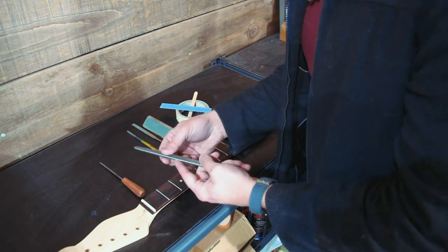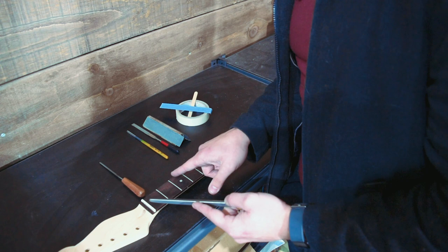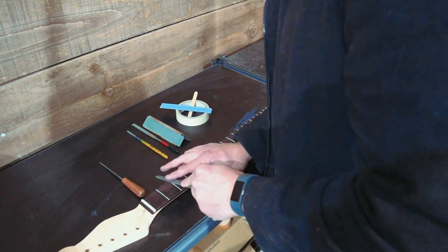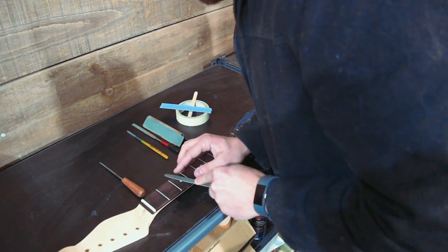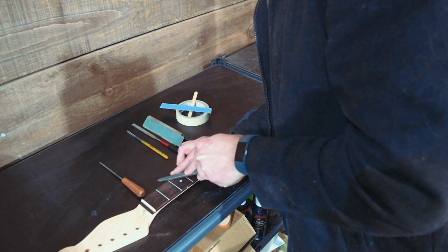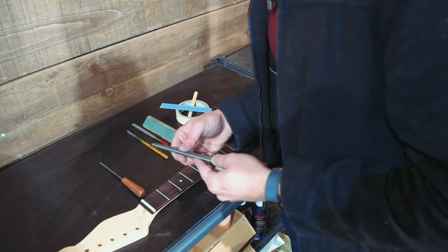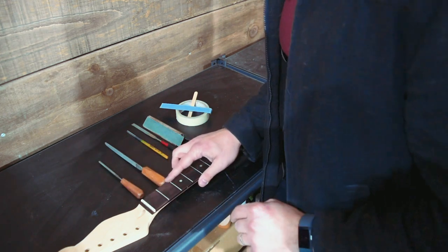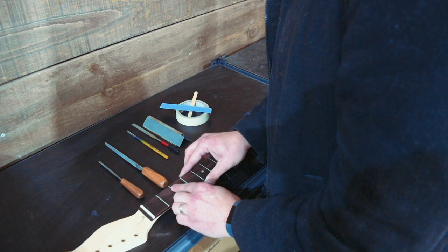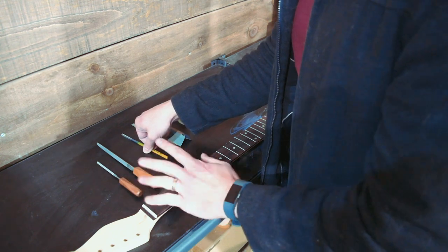This three-corner file is a little bigger and a little more aggressive. It still has a smooth side, but because this is rounded, you're more liable to bump over the edge of your fret. You just have to be more careful. When I do it with this, I actually have a finger on top — more contact points with the tool — just in an effort to be as careful as possible because I don't want to damage anything. This is a nice fretboard and it's being used for a project. This is a little quicker, but this file is frankly too aggressive. When we take a look at that fret end, you'll be able to see there are actually some noticeable scratches there. So the answer to the initial question — do you need both? Yes, you need the finer one. This guy is going to leave some scratches and they're going to be tough to take out.